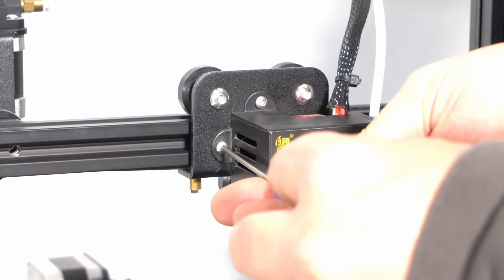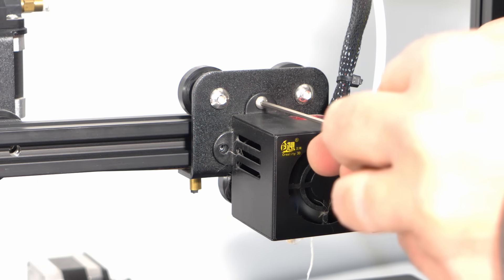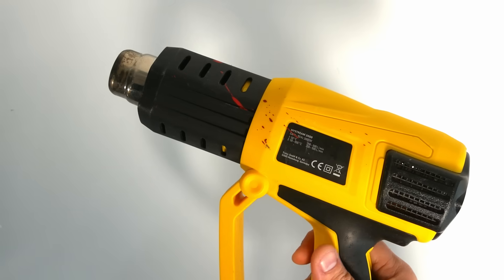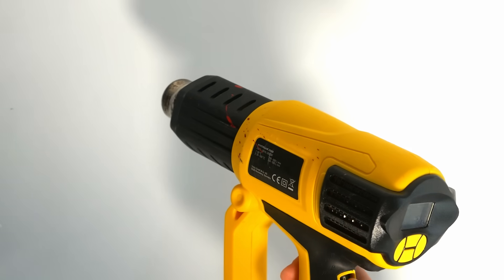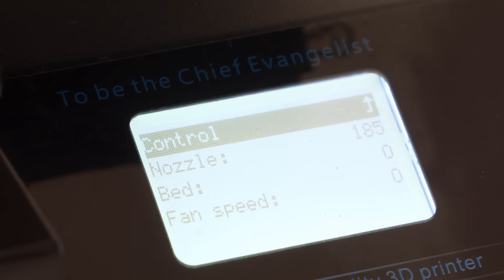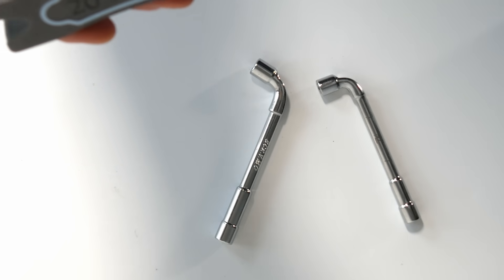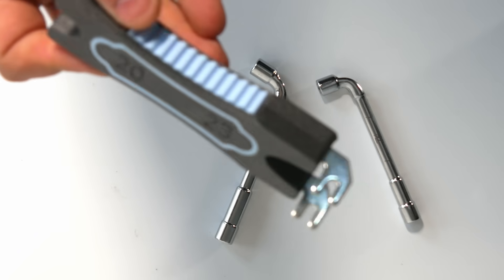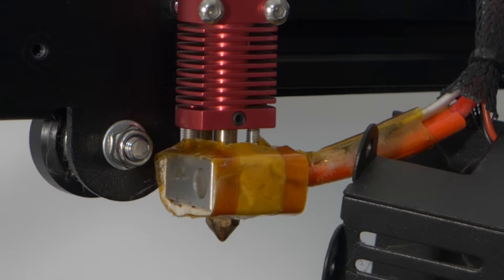In both these cases it would be ideal to take apart the hotend to clean out the path. While this sounds like a headache — well, it's actually because it is — it is the necessary evil that at some point you will need to tackle. One tool I always recommend having is a heat gun, as this makes life a lot easier when dealing with a 3D printer. The first step is always to heat up the hotend and remove the nozzle. The heat will expand the metal within the heat block, which in turn makes nozzle removal much easier. To remove the nozzle, most heat blocks need to be held in place by a spanner of sorts in order not to undo the heat break.